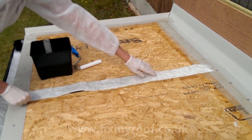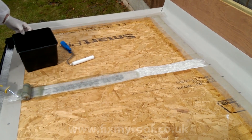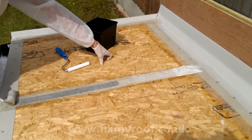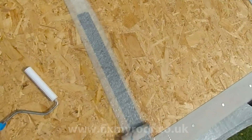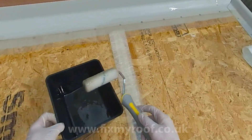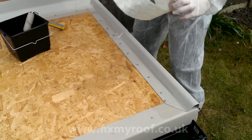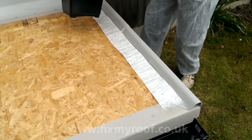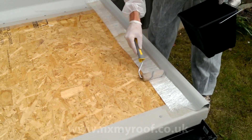Now the bandage between the roof board joints. If you put the resin on too thick, just push it around to where you need it. Any that's spare or spills onto the decking — roller it flat or pick it up on the roller and move it about. Now putting down my last but one bandage — if you notice, my other bandages are starting to turn transparent. This means the binding agent in the matting has started to break down and they're ready to be consolidated with a paddle roller or thin roller.